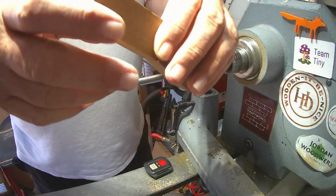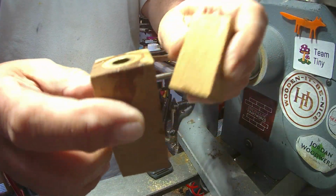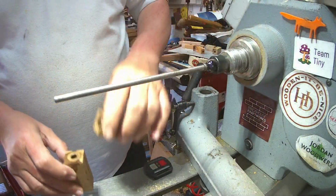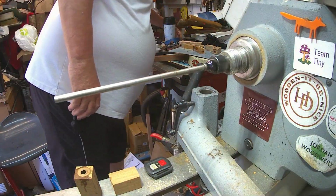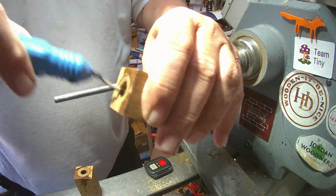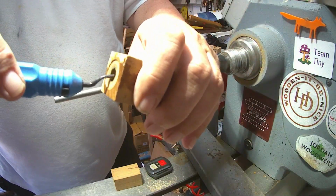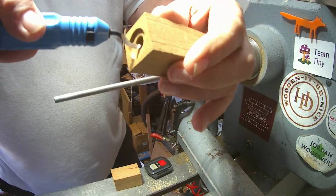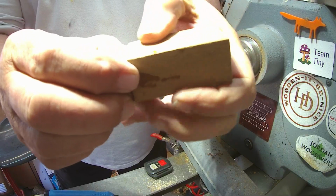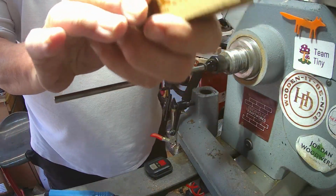Good morning. So, all 5 have been barrel trimmed. I did end up super gluing them or CAing them in. So, one last thing to do before we put them on the mandrel is a quick deburr. And then try and keep the grain alignment. Obviously once we start turning, that witness line will go.